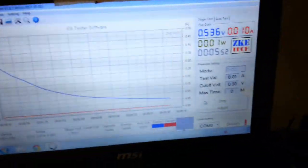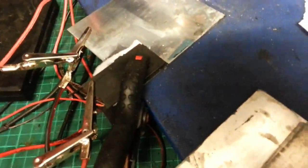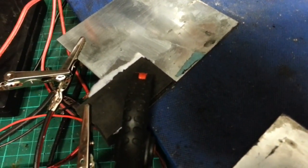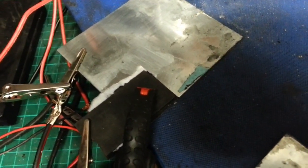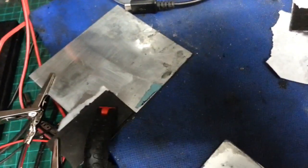Now this is quite interesting, because that small battery, the one I didn't get around to trialling last night, here it is at the moment. I've changed the load to 10 milliamps because of the capacity of the battery. That's the active material with some of that stuff in it, the zinc hexacyanoferrate. It's my active carbon that I've had in the ball mill for a lot of hours. I turned it into a better material as far as I'm concerned, and put some zinc hexacyanoferrate with it, and I didn't get to trying it because that power supply was playing up. So I've charged it on this one for about a minute or less, run it at 10 milliamps, and look at that.